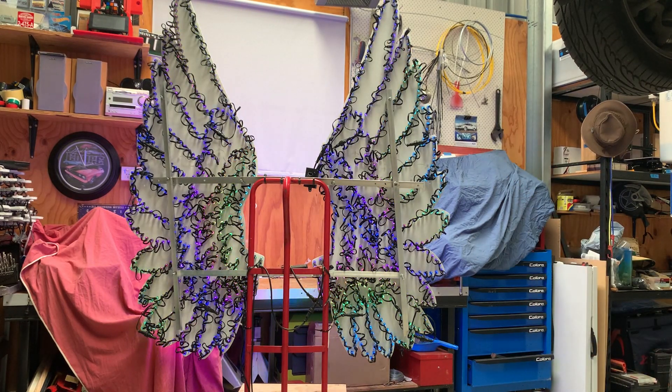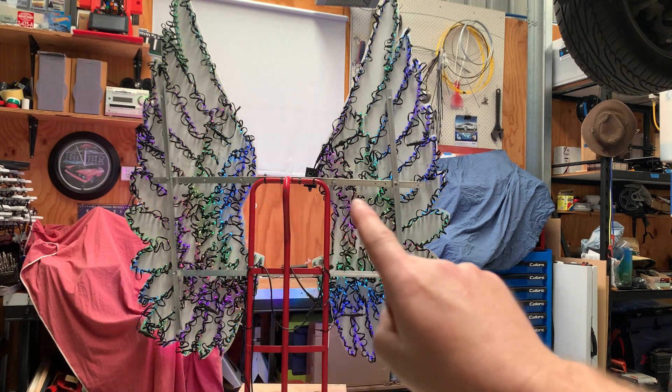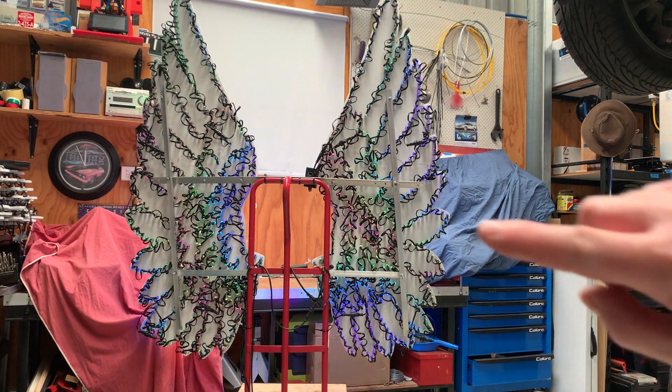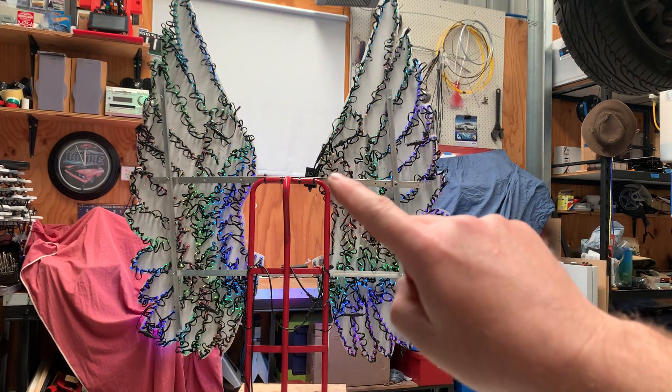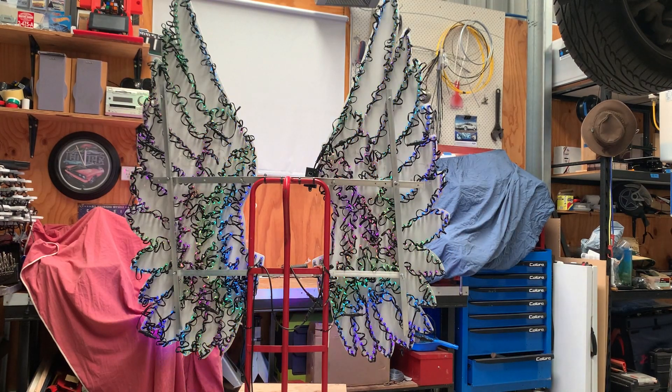As you can see from the rear of the selfie wings, we've come up with a super dodgy mounting system. I probably wouldn't recommend doing it this way, but it works. Some other people have made some really cool mounting solutions and you're probably better off to find those. But hey, it was a quick build. What we've got is some aluminium angle going across horizontally, simply cable-tied to the top of the little hand cart so we can wheel it around, with a couple of vertical braces on the back. The wings come as two parts — there's a jigsaw coroplast design where they interlock with cable tie holes, but it just needs that little extra vertical support if it's out in the wind.